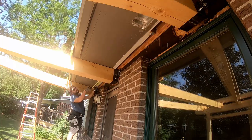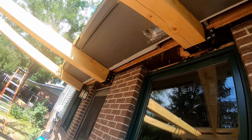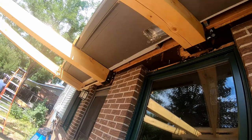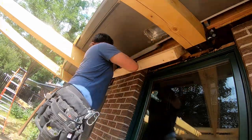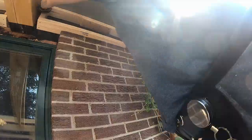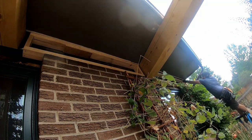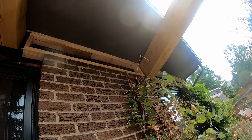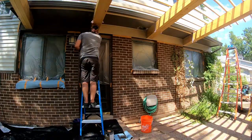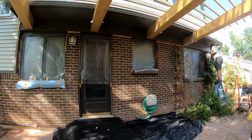This is a little out of order — I actually did this before most of the rafters were installed. Part of the job was building these wood-frame boxes that go between the beams up against the house. When we removed the old pergola and the round beams, all this stuff was also kind of rotted and a different size, so it made sense to completely clear the framing and rebuild it. I built some two-by-four boxes and put them up into place between the beams, then fit two pieces of cement board siding on top that matched the rest of the house, caulking neatly around all the seams to the large beams. Then I put on a coat of paint which looks black but is actually a dark brown.